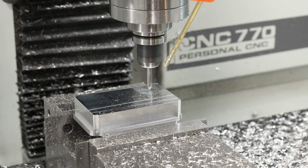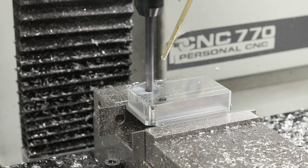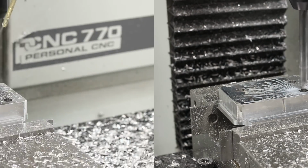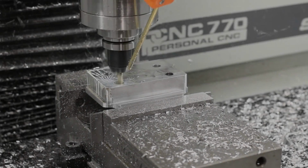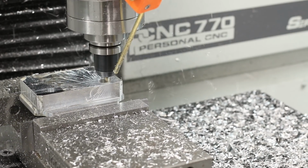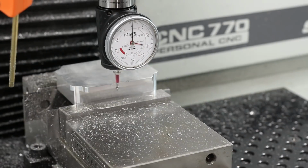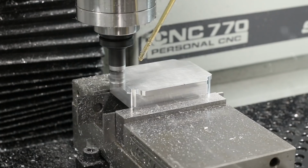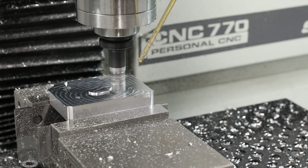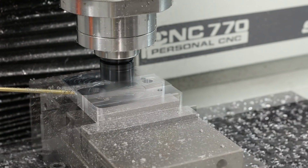After we put a chamfer on the part, we're going to spot and drill the holes not only for the mounting hardware to the base, but the diamond pins for the mod plate. And after the part is flipped over for op 2, we're going to deck off the extra material with the shear hog using the same recipe as before. And then come in with the Superfly using the same recipe as before as well to face that surface off so it sits flat on our base.